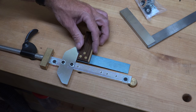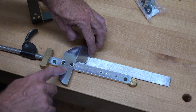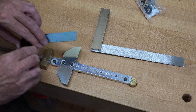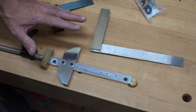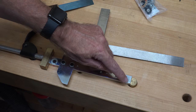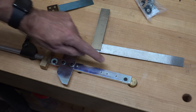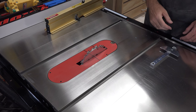With the jig on the bench I've checked it repeatedly with several trusted squares to ensure this plate is 100% square and 90 degrees to the miter slot bar — double checked, triple checked. I've also placed anti-seize on all four bolts so that for later adjustments I can get them out easily. These nylon discs do wear over time and need replacing, so anti-seize on those bolts means you won't be fighting stripped allen screws when that time comes.